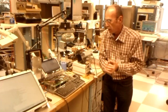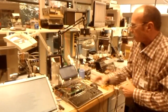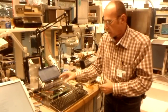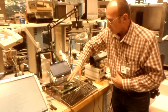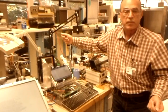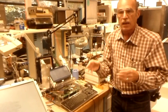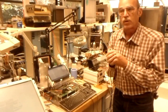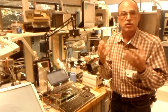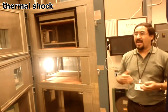As you can see here, I have two PSG products going right now — this is how they actually are in the test. This is a completely gutted portable unit: the board and the display with all the plastics removed. This way we can get as much vibration to the PCA — the printed circuit assembly — as possible. The more vibration we can get to it, the better the response and the more issues we can see.